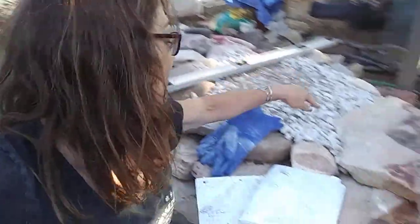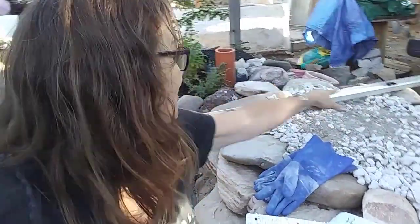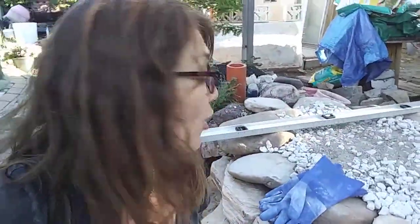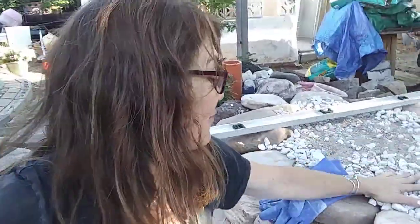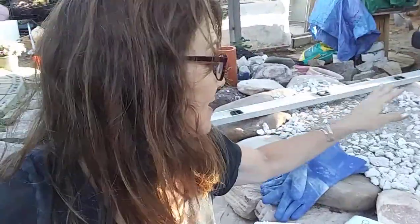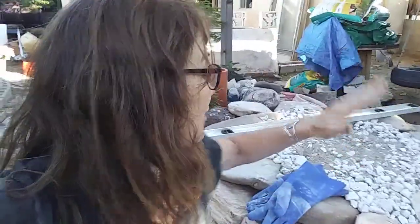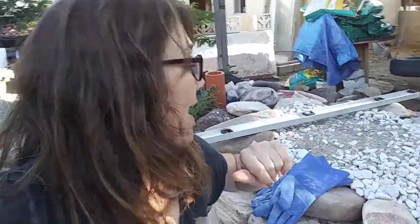On top of that I've made basically a little scoop, a little bowl with some stones. I'm gonna put a few more over there, or I could fill that in with my hearth mix. I've put some insulated mix — this is pumice stone, it's real light rock that floats in water, it's highly insulated. I just happened to have some mixed into some sand, leftover from a previous project, so I dumped that into this bowl. Now I'm gonna mix up a mixture.